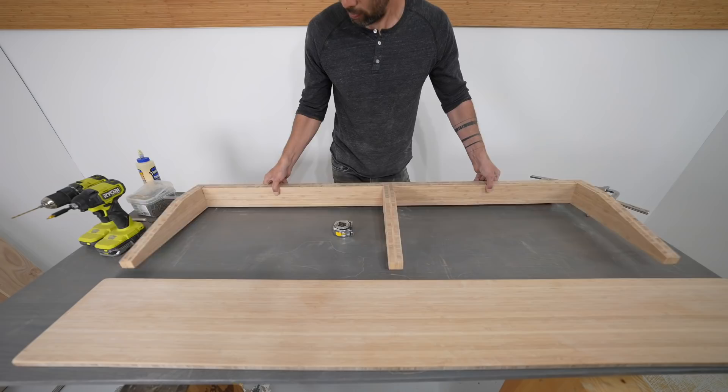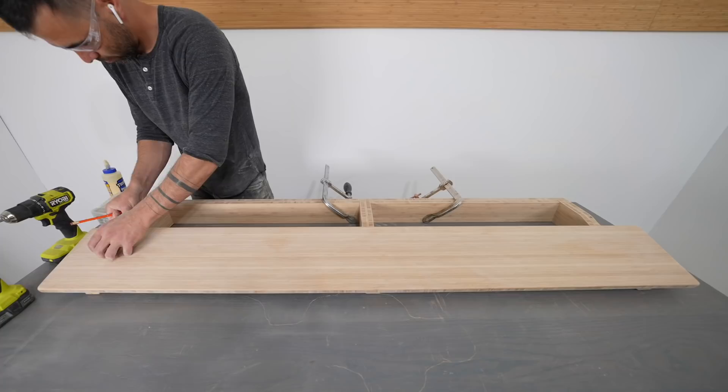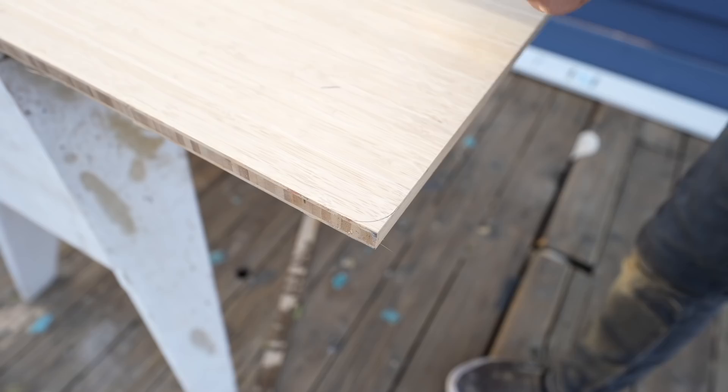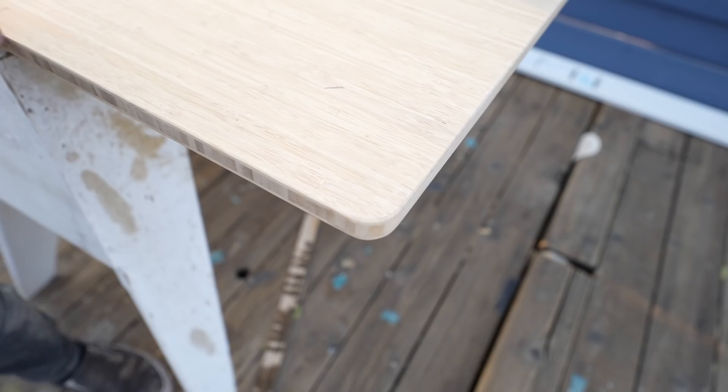In general the bamboo plywood is really straight — far straighter than typical plywood — but the base plate was a little bit uneven when the glue was curing so I just clamped a 2x4 to it to straighten it out before attaching the backrest. This sofa has built-in side tables so I used the full 8 foot length of the sheet of plywood to make the board that will go under the cushions. I get a lot of people worried about their shins so I just traced a radius around the corners, trimmed it with my jigsaw, and then sanded it all smooth. This will just soften up the edges a little bit.